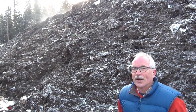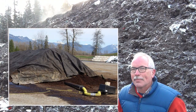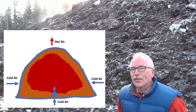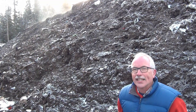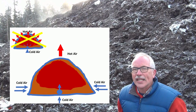The solution is to provide aeration. By placing a 4 to 6 inch diameter pipe underneath the bottom of the windrow, we achieve two things. First, we add oxygen to the core of the pile, which allows that pile to heat up and create the vacuum required to draw cool air in from the side. Secondly, the force of the air coming up through the pipe creates a bit of an aspiration effect where it also draws in cold air from the side.